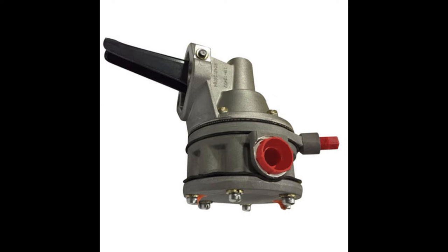In order to operate without the electrical fuel pump, you need an engine-driven fuel pump. The engine-driven fuel pump is bolted directly to an accessory pad on the engine crankcase, and it delivers fuel under pressure to the fuel injector.